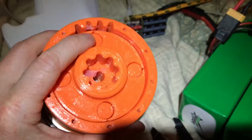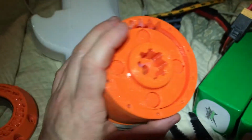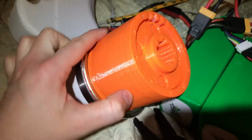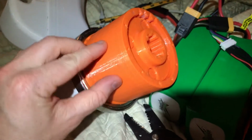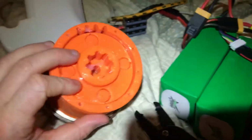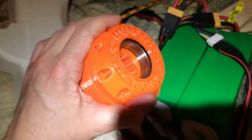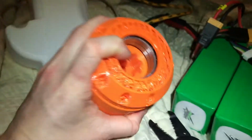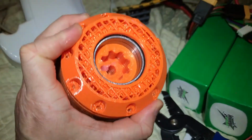Now, in my previous robots, I have not had any failures here. So I was pushing the gearboxes really hard, and I made this two-stage gearbox. There's a single planetary stage in here coming off of the motor, and then that feeds an output plate which has a new sun gear on it that goes up into the planetary stage here, which goes into this output plate, and then this beautiful cover will be screwed on here, and then you'll see it looks kind of like something from Mario, but it's the gearbox for Rover V2, and this is the new gearbox.